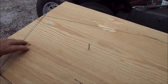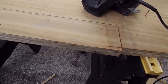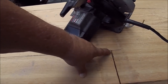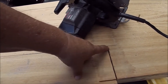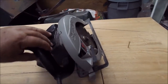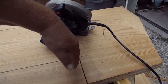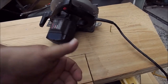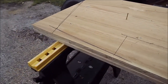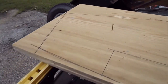I've got these two screws where I can miss it with the skill saw. When you're using a skill saw and you're trying to cut out something with an inside corner like that, you run your blade right up to it. Just because of the configuration of a skill saw, you need to stop right there and come back with a reciprocating saw or jigsaw to finish the corner. Same thing here — run your blade right until it touches the line and quit.